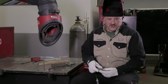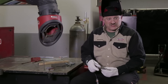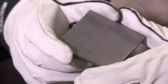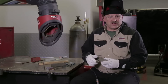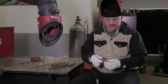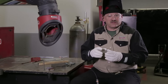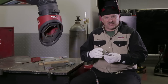The steel we welded on today was a cold rolled steel — the mill scale had been removed from the steel maker. A lot of steel is hot rolled and has mill scale and/or surface rust on it, and that should all be ground clean before you weld. In this case we had pretty nice clean steel, so we didn't need to make any special cleaning arrangements. Afterwards, a good brush job will make that appear really nice — a nice shine to it. And if you're going to leave it as is — not paint over it, you want that bronze to show — a clear coat will keep that gold color in the bronze. If it's for architectural or artistic purposes, you might want to keep it gold.